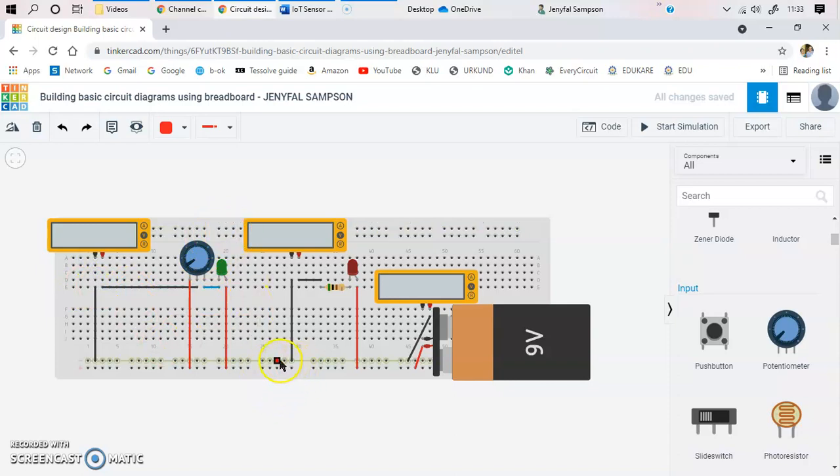So please remember: short circuits exist in columns on the internal part, whereas on the outer parts, the entire row is shorted. On some breadboards, you'll notice that at the halfway mark there will be a split — the right side is entirely independent of the left side. With TinkerCAD's breadboard, everything is shorted, but on a practical breadboard there is a half-split where there is no interconnection between the left and right sides.